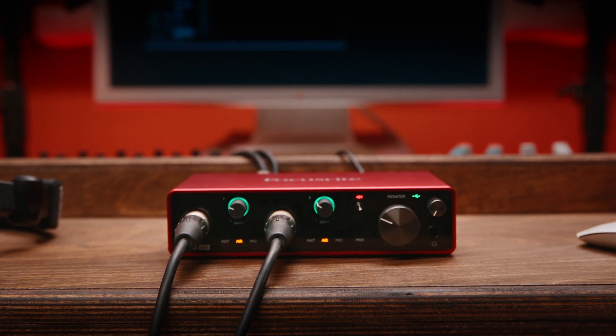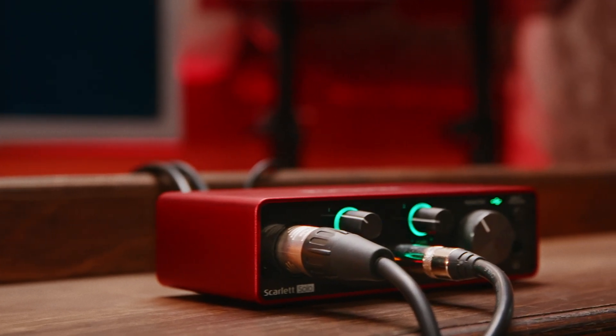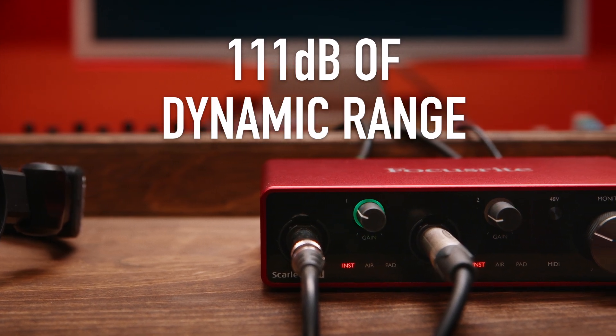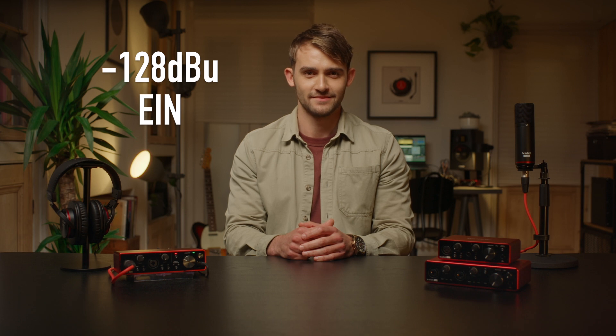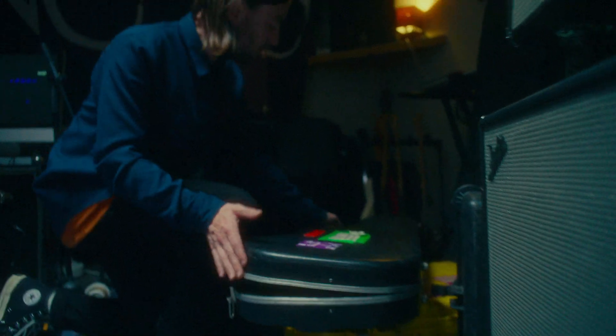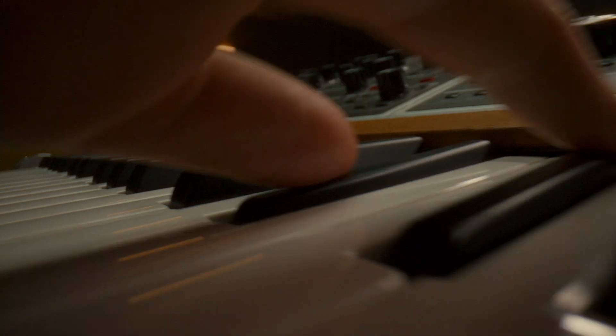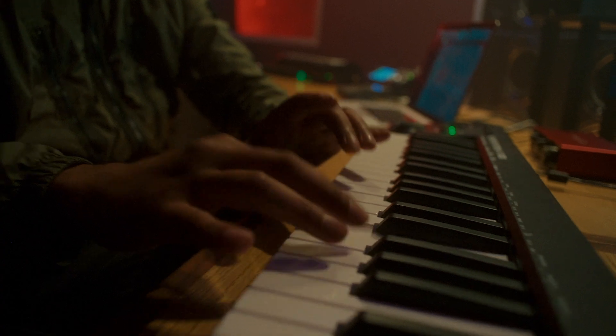All three of the interfaces we're looking at here have some great features in common. Scarlett's third generation microphone preamps deliver incredible clarity and low noise. Combined with our converters, our third generation mic pre's deliver up to 111dB of dynamic range on the way in, based on real world performance, and -128dBu EIN. We have a 56dB gain range too, so you can get great performance out of any popular studio mic. We only ever share real world performance because that's exactly what you're going to get — it's how your mic pre's and converters work together that make your recordings sound great, not chipset specs. With Scarlett third gen we've struck the perfect balance between dynamic range and sound quality, so it's easy for you to get studio sound anywhere.